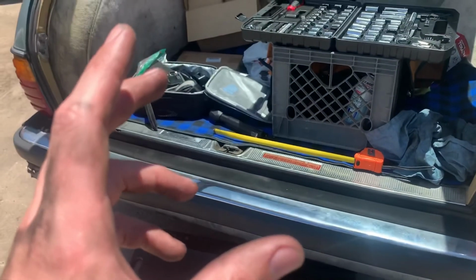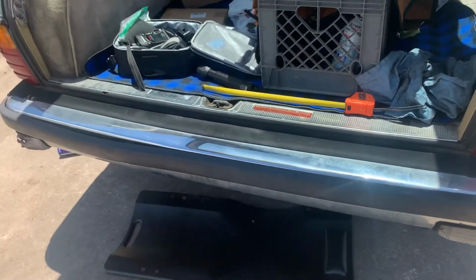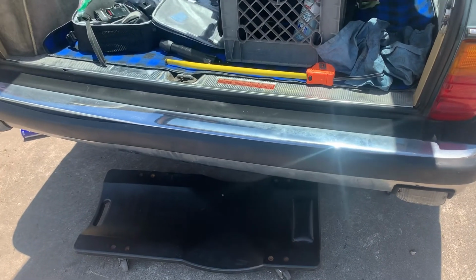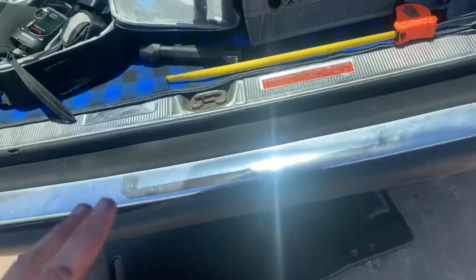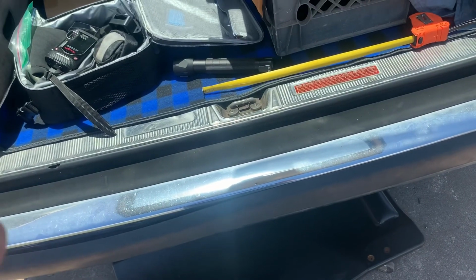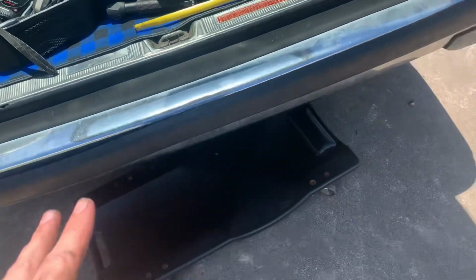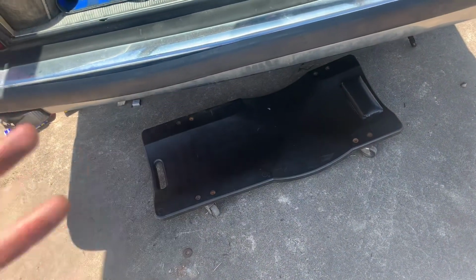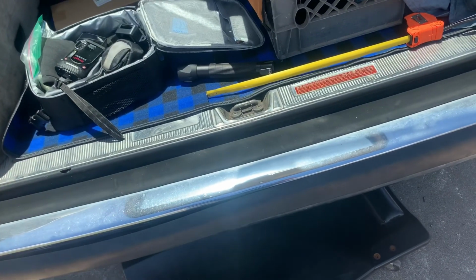Definitely leave that valve loose when you tighten those lines down, and be very careful because those top two do thread into aluminum. It's very easy to cross thread, so make sure you do not cross thread those. They should go in super easy. Shouldn't be tight, starting off. So yeah, just be really careful with those. You cross thread them, you're buying a new housing.